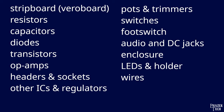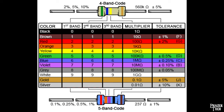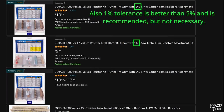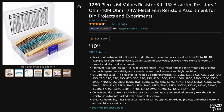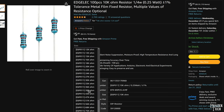Now let's talk about resistors. There are two specifications to look for: first is the power rating — for guitar pedals you can stick with quarter watt resistors since pedals don't use much power. The second specification is resistance. Since pedals contain a number of resistors with a wide range of values, I recommend getting an assorted pack of quarter watt resistors. The more values a pack has, the better — for example, one pack only has 17 values, another has 25, and another has 64, so that would be my choice. Some resistor values are more commonly used than others, so you might need to buy packs of specific values if you do multiple pedal builds, since you'll probably run out of just a few values.